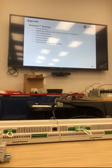So what it would do in the new program is that, for one, if it's going into dehumidification mode based on the space conditions, then it should come out of dehumidification mode and heat up the space if it actually needs to. I think some of the changes we're making now are going to give the unit more reheat capacity, so that it's not actually a problem. On the application, I had that problem. Basically, it looked like it was way oversized for the space, there wasn't anything in there. And Jimmy just told me to put it out of service. Yeah, because it's more of an informational alarm saying that we're in dehumidification mode and we overshot the space.